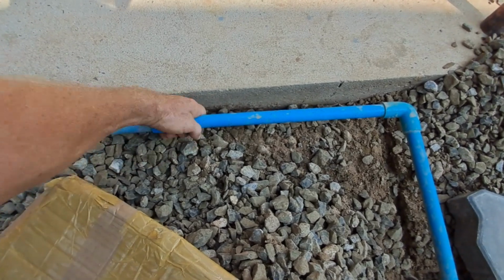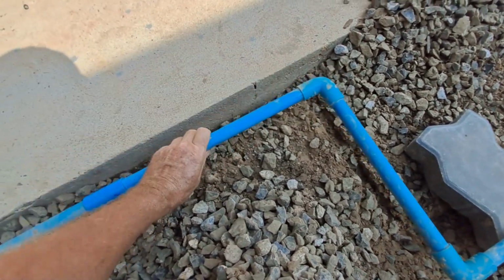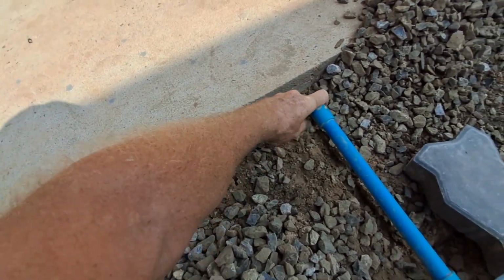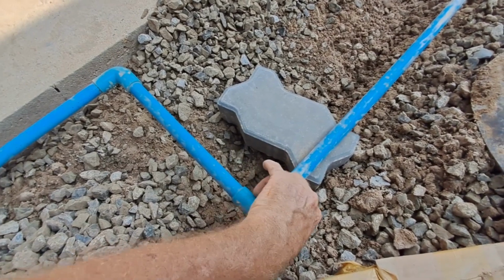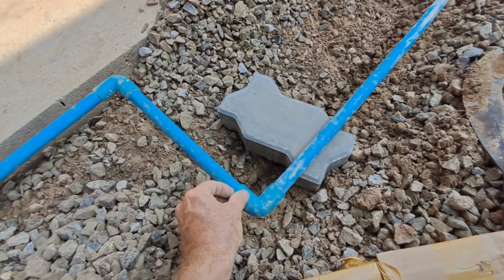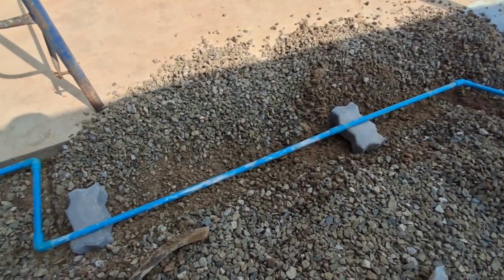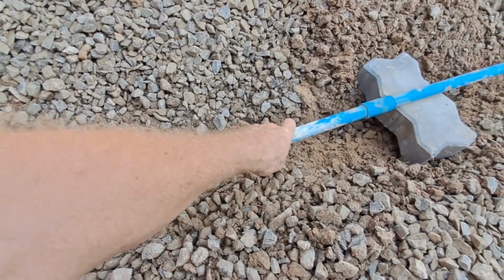I'm so confident in my plumbing because I know that the reason these things go wrong is lack of glue. Whenever someone builds a house and the builders do the plumbing, they invariably get a leak. It's common practice, unfortunately, for them to bury their pipes in concrete and tile the bathroom and do everything without pressure testing the system. Then they find their pump is cycling far worse than I've got, and they have to do what I'm doing, turning off valves and working out where the leak is.